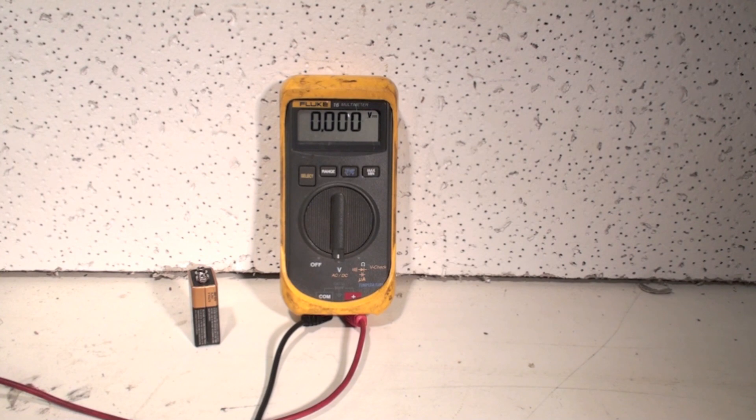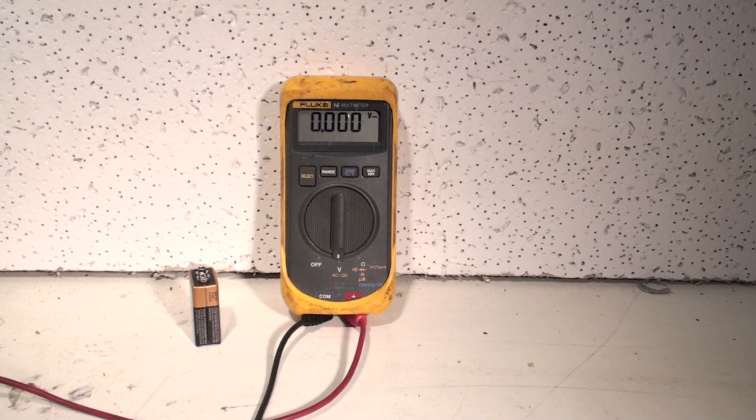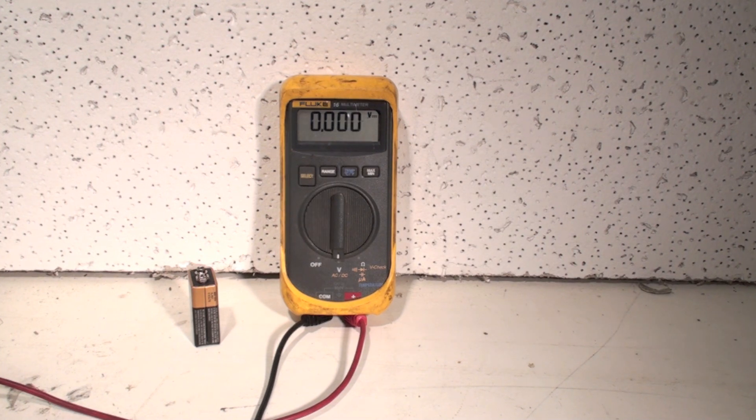So that's the usage of the multimeter. It's probably the most versatile meter we have. You can use it for just about anything, including capacitors, very high resistances, very low resistances, and voltages up to about 600. And that is the modern auto-ranging multimeter.